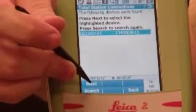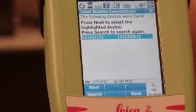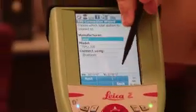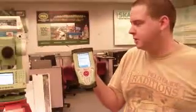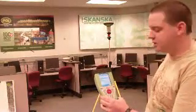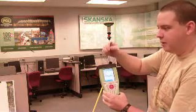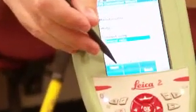The only Bluetooth picking up right now is the GS sensor, so it apparently does not connect by Bluetooth now. That's fine, because Bluetooth is only good for about 30 feet. The GPS sensor and this controller are probably never more than 5 feet apart since you'll have it on the pole while walking around, so Bluetooth to the GPS sensor is fine. But you'll want to be connected by internal radio to the total station, because you're probably going to be several hundred or even a thousand feet away. The internal radio is good out to about a kilometer, which is the range of the instrument and reflector anyway.